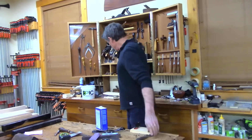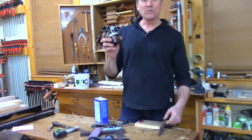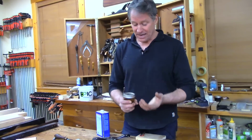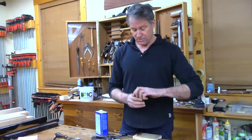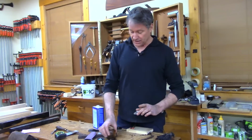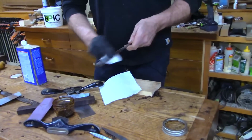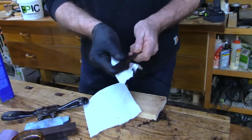I'm going to just put a little on here. And then I'm going to wipe on the most foolproof of finishes, one that adheres beautifully to it, our good friend shellac. And we've got wax-free orange here that I mixed up in November. So this should still be fine. I've got a 1.5 pound cut there. We're going to wipe it off, and this will flash off really fast. It kind of draws the oils out and takes the surface oils off. That looks black already, huh?